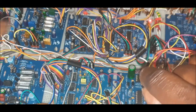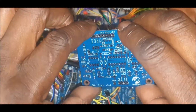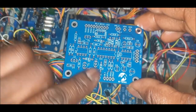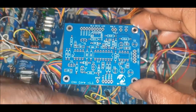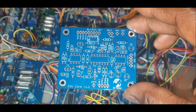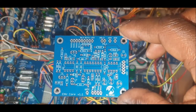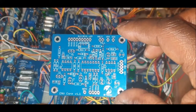What is not apparent here is a very small addition, which I did quite late in my breadboarding session, where basically the gate in will have a switch, so you can switch between an LFO, or you can have the normal 10 volts gate coming in. So we can switch between having a looping envelope, which can be quite useful, or we can just have it fired normally from the gate.